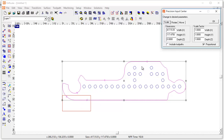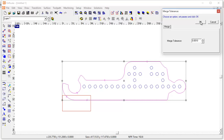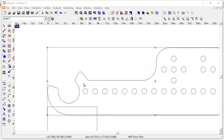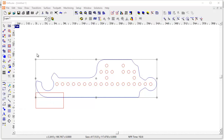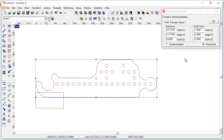You can do it in millimeters as well. So I'm going to, first of all, merge this. Those are pink contours around the outside there, and I wanted to merge it together into all closed blue contours. Now I'm going to hit F2 for the precision input center, and I'll select this again.